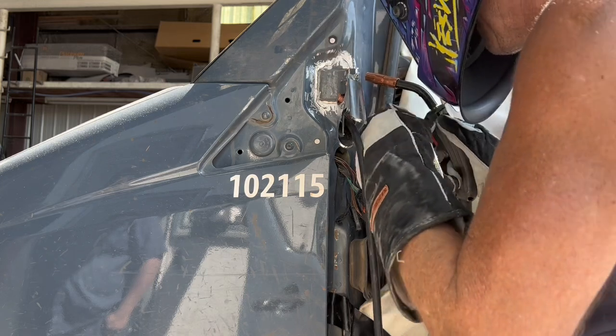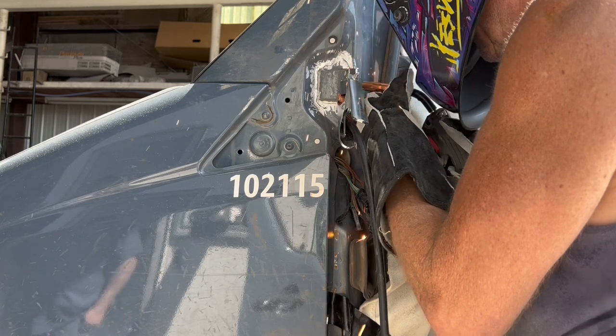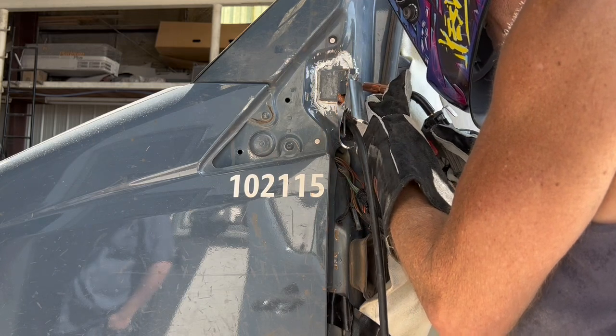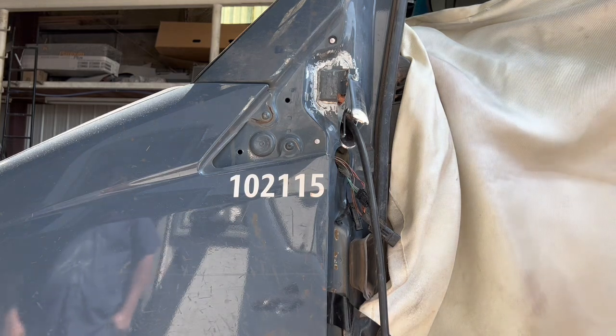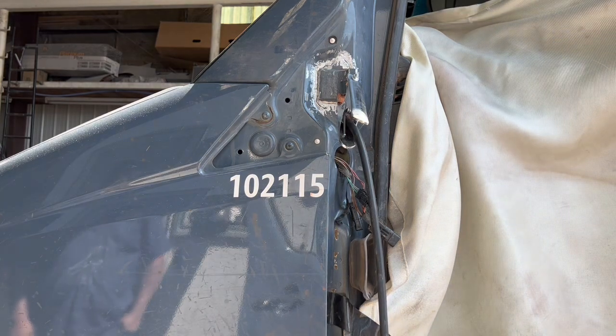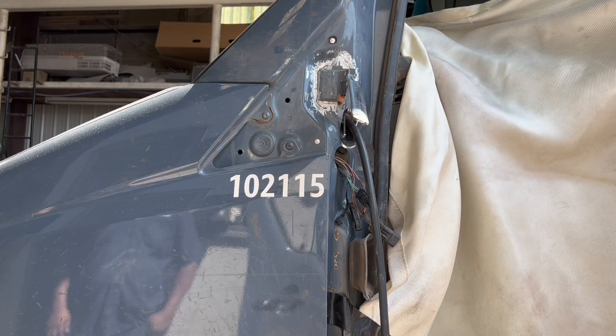I'm having to look and see if I'm in the right place because I can't see where I'm going to start welding, and I'm about to give up because I need to be able to see that puddle. I'm trying to weld thick metal to thin metal and I absolutely need to see what I'm doing. Luckily, I'm going to put my hat light onto my welding helmet — even though the sun is shining into the back of my welding helmet, the headlamp will put out enough bright light right where I need to weld for me to be able to see it.